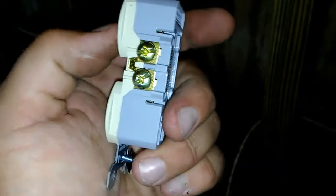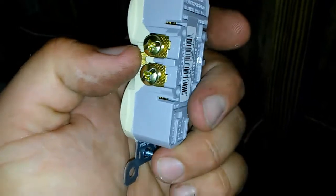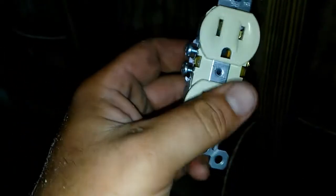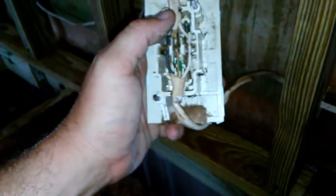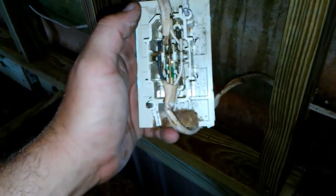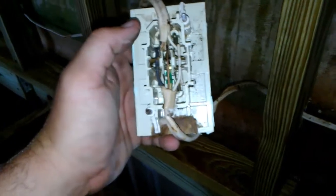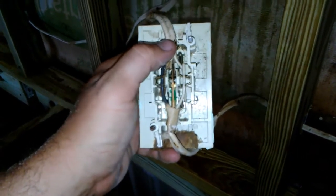That's how the electricity works — it has to transfer through these blade connectors from wire to wire to continue on down the line. You've got a nice solid copper bus on a standard outlet. Like I said, duplex outlets work well for 15, 20, maybe 25 years without problems, but you're going to have to replace them eventually — and that brings up the other part of the problem: the tool.